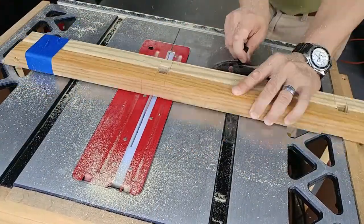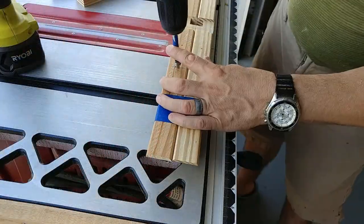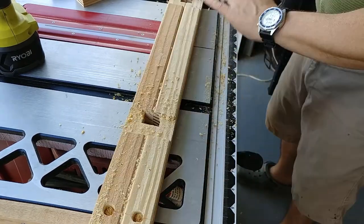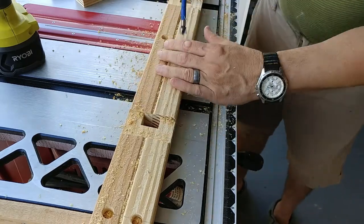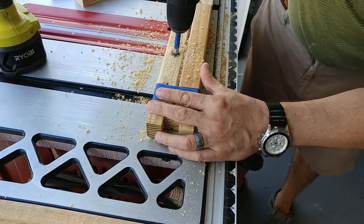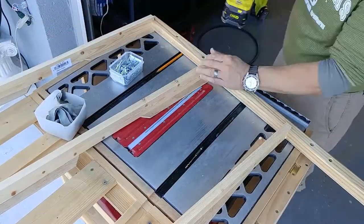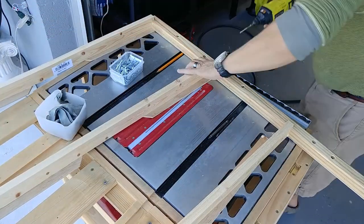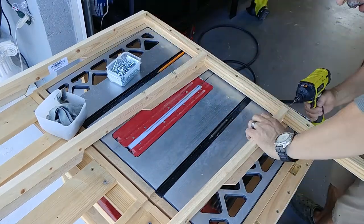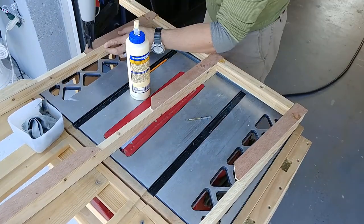After making the quarter-inch by 1.5-inch dado, it is time for assembly — but not before making some holes for the mounting screws and for the bungee cords. I may sound like I'm rushing this, but honestly this doesn't have to be complicated. If you're building a spice rack or a food storage rack for your pantry in red oak or something like that, I can see putting a little bit more attention to detail. But for a spray can storage rack for the garage, this more than does the job. To hold this thing together I'm using 1 and 5/8-inch coarse-thread drywall screws for the horizontal bulkheads, and brad nails and glue for the vertical support.